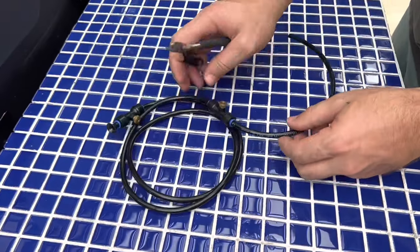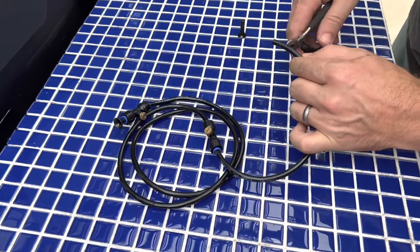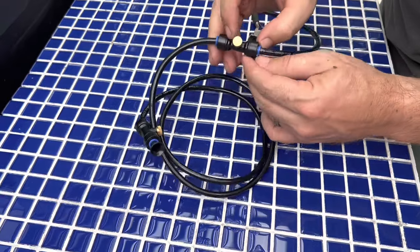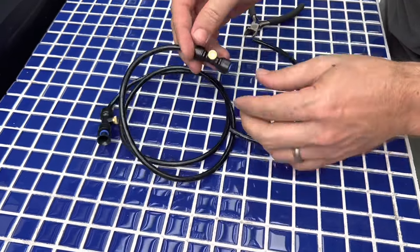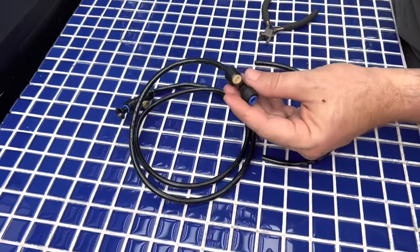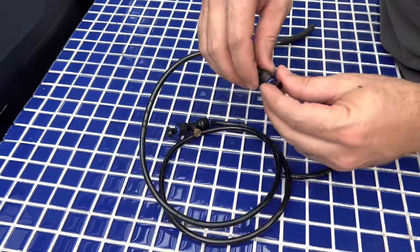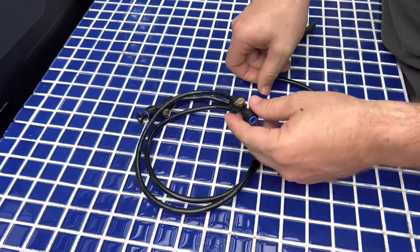If you need to trim the misters to be centered where you want, you can just cut this hose very easily with any sort of scissors. You can also push into these blue connectors — if you push in, you can pull the hose out, which allows you to trim the length in between so you can get it centered just right. It also came with an extra plug, and there's one at the end — you just push it into the very end and that'll be the end of your line. If you want to remove it, you push in and pull out. Once it's in, it's self-connecting.